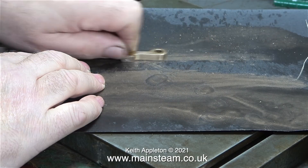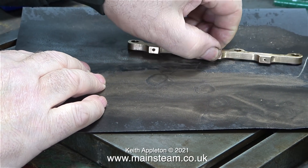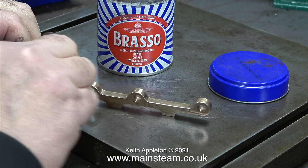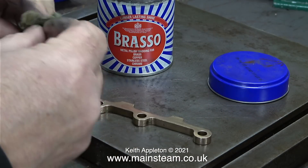Here's some WD-40, sprayed onto a piece of wet-to-dry sandpaper which is 400 grit. It's just a case of rubbing the part up and down for quite a long time until the tool marks disappear. This clip is taken from the end of the sequence and as you can see it's quite a lot flatter and smoother. I then took it to the polishing spindle with some abrasive.